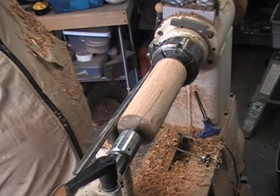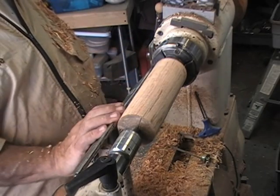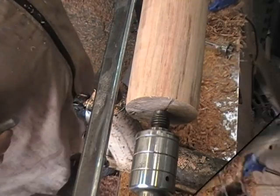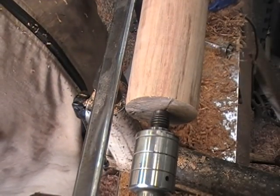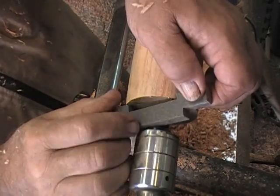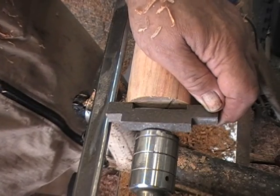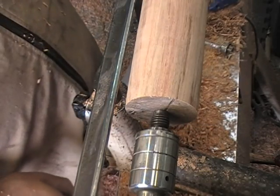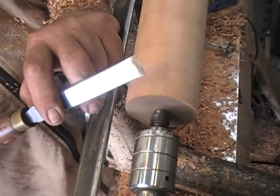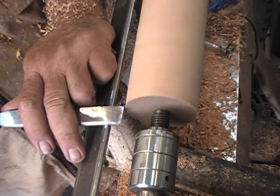Once you've got a hard look at it, then we want to make it to where we can hold it in this jaw so we can drill it. So we're going to put a tenon over here. Actually, I misspoke because I have the chuck in my way on the other end. This is where I would put my tenon. My target is to get somewhere around that size right there, so my chuck grabs it pretty well. My tool for doing that is this skew that's raked at the same angle as the jaws.